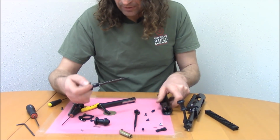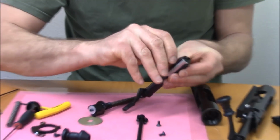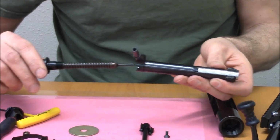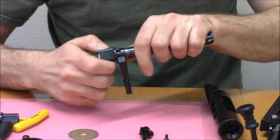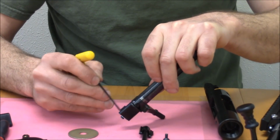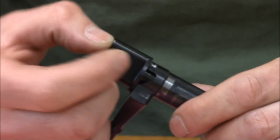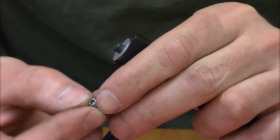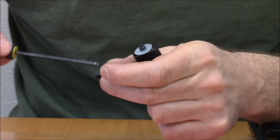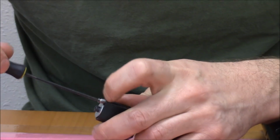Yeah, so the bolt shroud, let's just continue the assembly on the bolt. So here's our bolt with our bolt head and our extractor. We're going to put that in there, screw this in here. All right. Once you have that together, there's a hole in the bolt shroud right here. Line that up with this little cut for the locking pin. Here's the bolt shroud locking pin right there. He goes in there. You can put this spring in behind him. And then I've got a nice fancy little set screw that we have custom made because it's got a really nice finished look to it. This one needs a little tweak actually, it's not sitting exactly how I'd like it to.